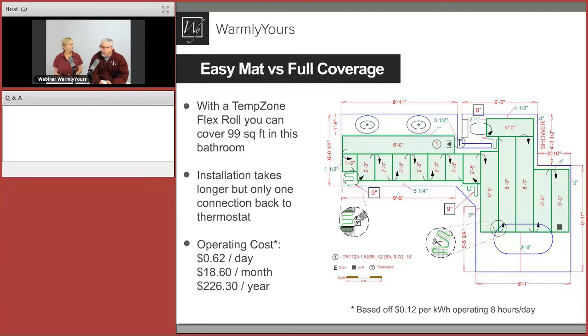Dick asked about power requirements and thermostats with scheduling. The thermostat can be set so it's warm by your wake time — say 6 AM — not just starting to warm at 6. The thermostat learns how long it takes to get from one temperature to another. If it needs to reach 84°F every day, it knows how long that takes and will start early enough automatically — maybe 10 to 20 minutes early — so you don't have to figure that out yourself.